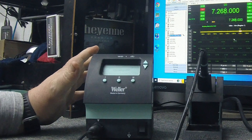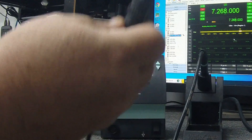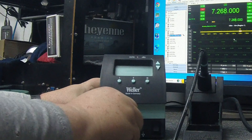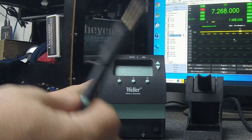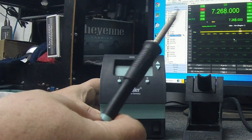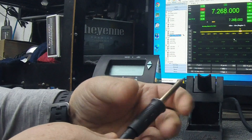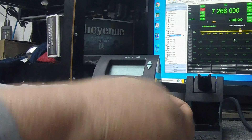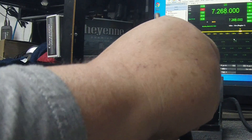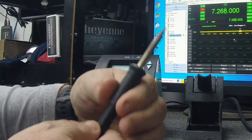It's really what it's designed for and it's also very versatile. It has this little half-twist unplugged type module — you can get solder tweezers for unsoldering SMT resistors, capacitors, etc. You get a wide variety of tips. This is the WP-80, which is my favorite tip — it's about a 70 or 80 watt tip. It's real easy to change to multiple different types of tips. I just have a standard concave in it right now. This is how you remove the tip — it just slides into the cylinder here, you drop it in, slide the pencil on, and twist it on. Voila, you've got your tip in.